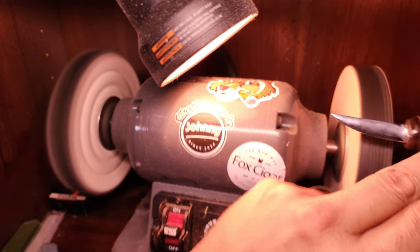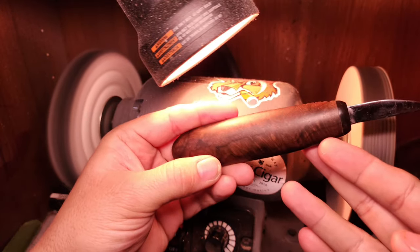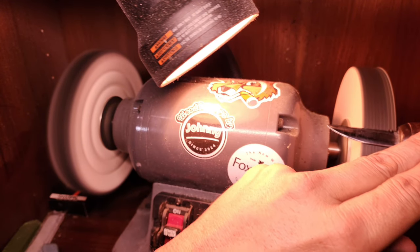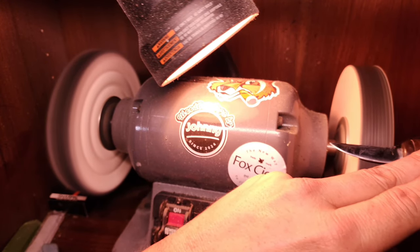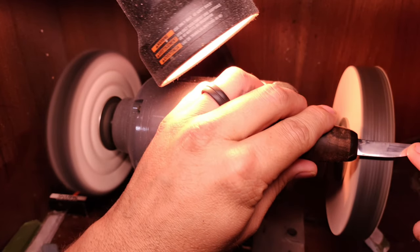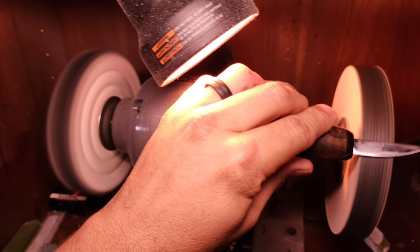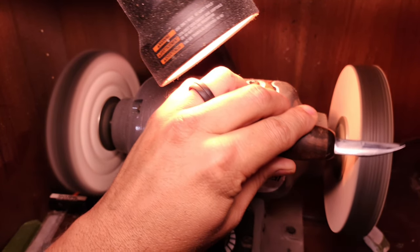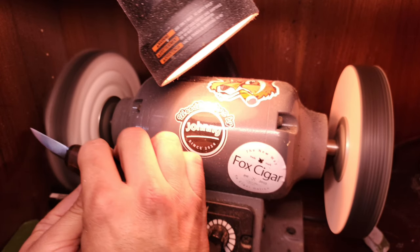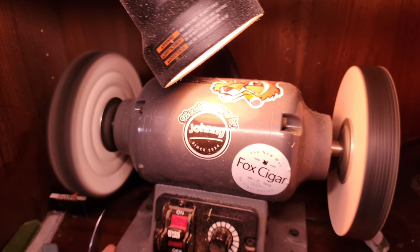Now I've got some other knives to do — just the knives that need to be stropped. This is my Beckwith Forge knife and it's a rough-out knife. Not touching the blade — blade's on the trailing edge of the leather. Work it across real quick, that bevel right down on there. Then over to the buffing wheel to clean that profile up on both sides so we make sure we get that burr off.